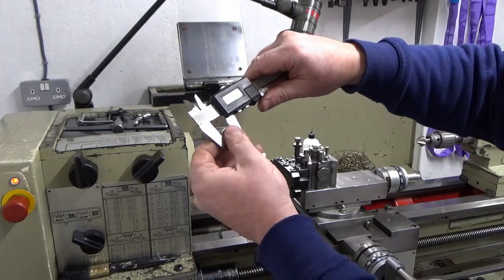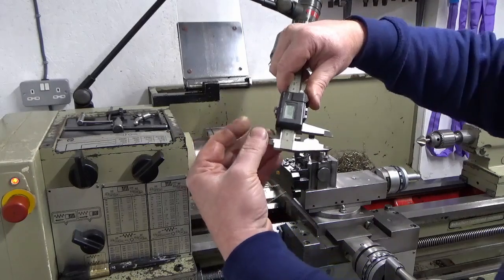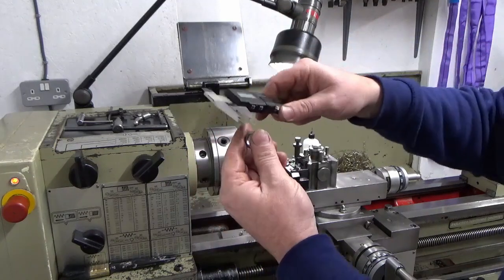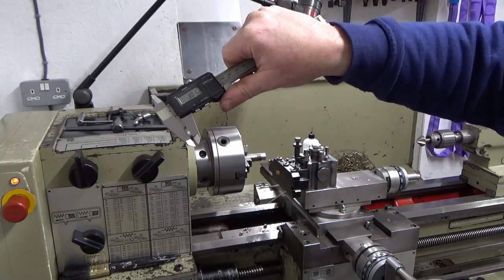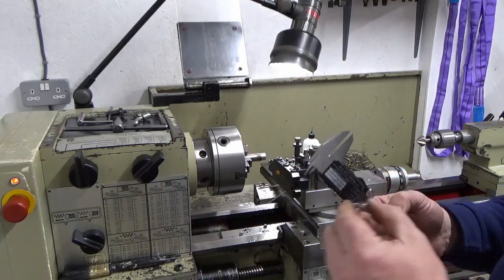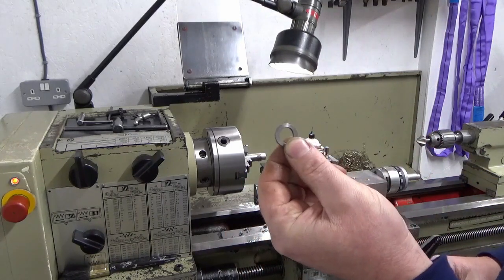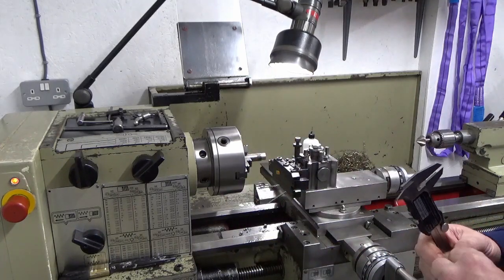We've got 18.03, a 12mm ID, and that is just a drilled hole, so we're 12.05, and we're 3mm width, and we're 3.01. So, you know, it's not difficult to make stuff like that, dead quick, dead easy. There's really, really no excuse for putting circlips on as spacers. So as I said, we'll move on and I'll bring you back whatever the next part of the cleanup is.